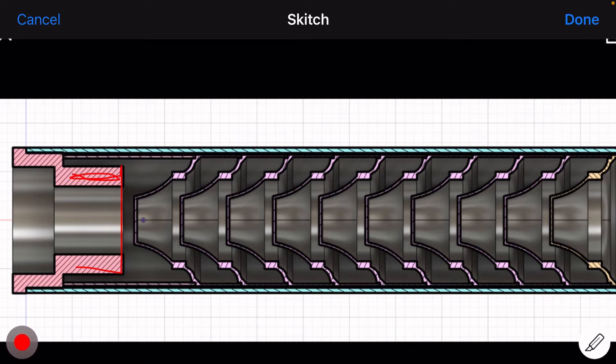What kind of benefit might there be? By bringing this gap forward, we could possibly make the chamber a little bit smaller, which could potentially limit first round pop. We'd also have a narrower area which would possibly force pressure to be a little bit higher and maybe utilize that area better — though that's idle speculation. One reason I never thought to go closer is that it could increase back pressure, which could increase sound and stuff blowing back in your face.